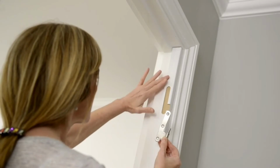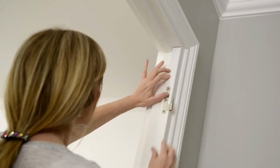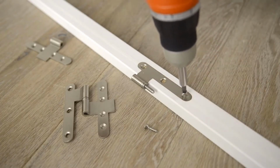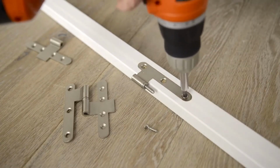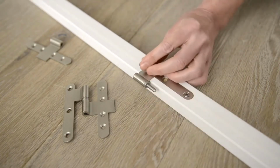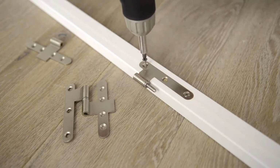The pre-machined area has a notch. This should be lower down to take the hinge. Fit the male part of the hinges into the two pre-prepared recesses and secure in place by screwing into the top and bottom holes of each hinge using the 20 mm screws. It is advisable that you drill pilot holes before screwing in any screws.